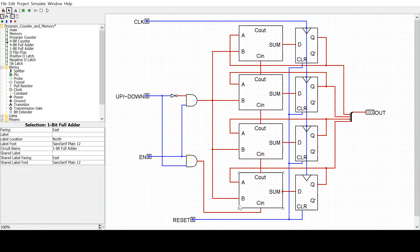When counting up, we're just adding the carry in and no B, so that's just adding 1 at the least significant bit — that's just adding 1. When counting down, we're adding 1, 1, 1, 1, which is negative 1. This enable here is very important, because that's what the control signal is going to be put into. If enable is 0, the output of both AND gates is 0. So if these are both 0, we're not adding anything in carry in and we're not adding anything in B. We're adding 0 to A — the previous value of the register — so we're not adding anything and we stay the same. Only if enable is 1 do we possibly count up or count down.